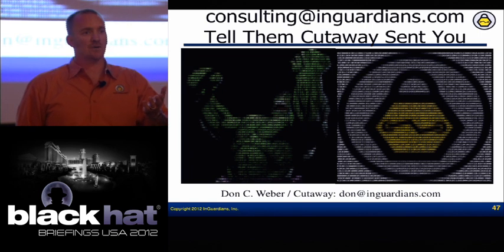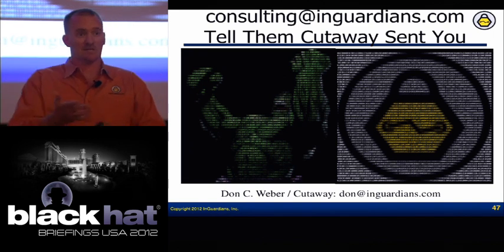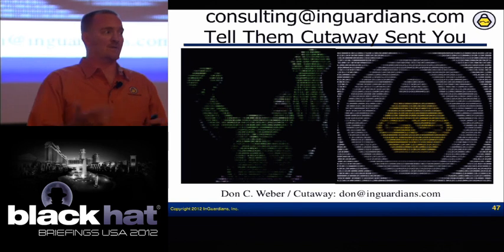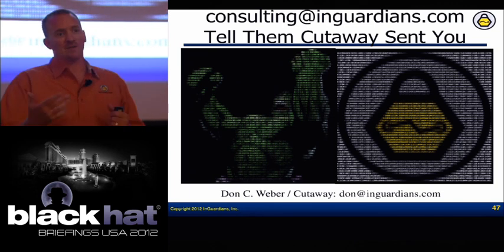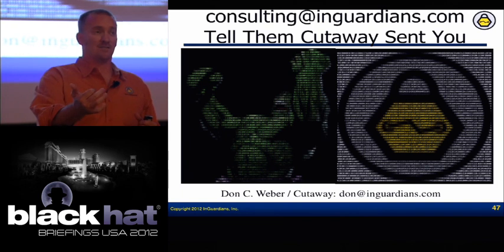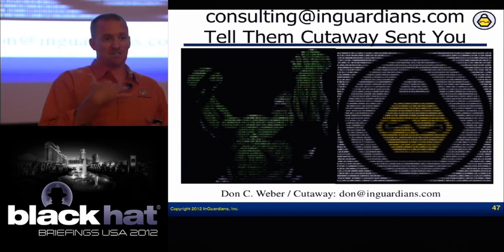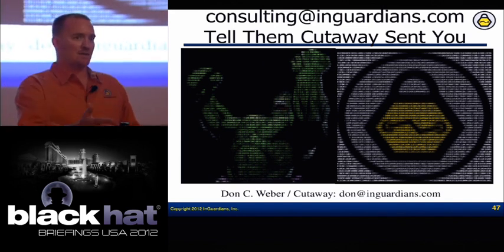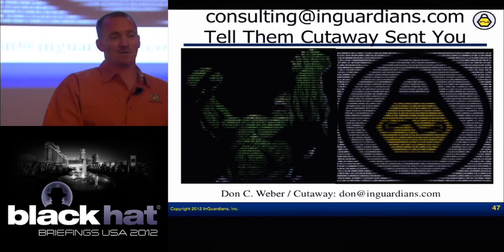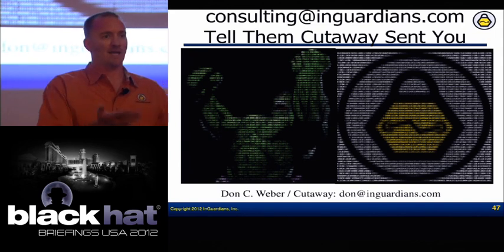Well, that's what the tool does. You probably still need to do some work to obtain the security code. But if it communicates with the meter already, then unfortunately since we didn't do a demo, you didn't see that it recognizes the responses. If I send something that's not what it's expecting, I'll see an error message come back. But if I see an okay come back, or a response that I expect, that means I sent it a good packet, and now I can continue forward. So yes, I can do assessments on meters via the optical port without doing any hardware assessment, but I can't tell you how far I can get. That's why we have the brute forcing capabilities.